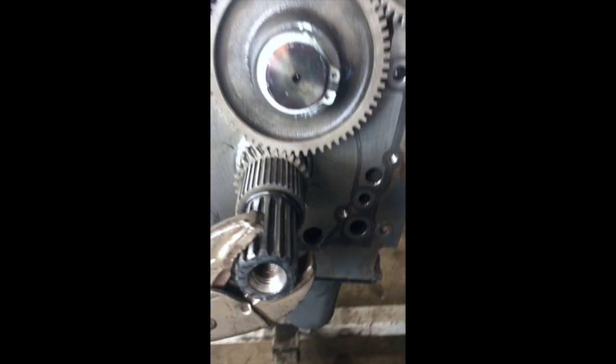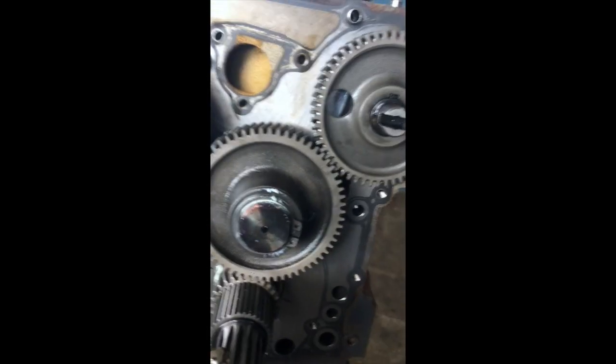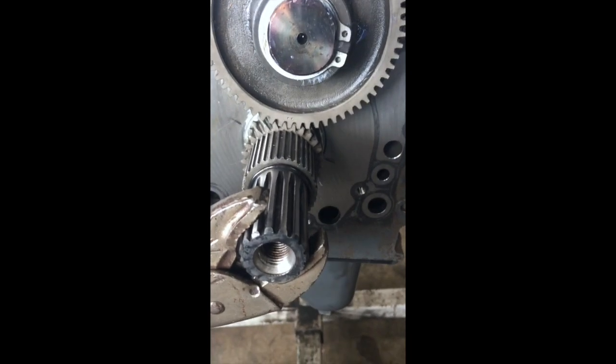All right, so we've got the injector pump and the shutdown and throttle levers on it. It's pretty straightforward on these little diesels. Got the pistons, rotating assembly, and everything torqued, oil pan on. Don't forget that on the crank stub there's an O-ring that goes right there that helps seal the oil pump and the timing cover, and actually it helps stop oil from wicking down the splines.